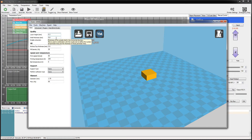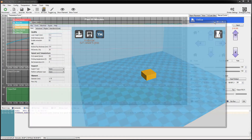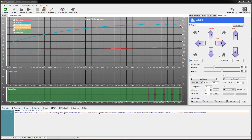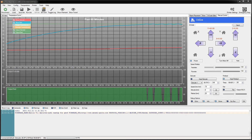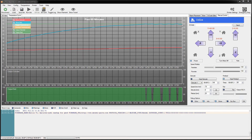So we'll see how that cube comes out this time. I'm trying to just change one variable at a time because I need to learn this sort of stuff - I don't really know how it all works yet. I've got that posted out to G-code. It looks like the bed's holding pretty well, oscillating a little bit so I probably need to run the auto-tune - this is just stock gains. But it's getting hot and I think I just need that first layer to stick, so I'm going to hit go on this one and see how it goes.